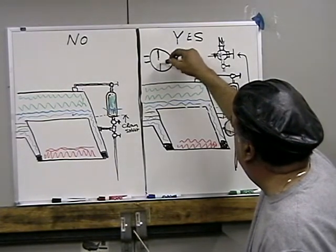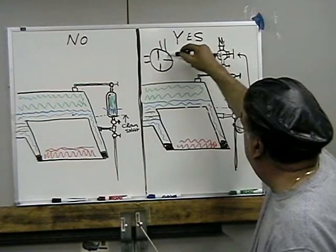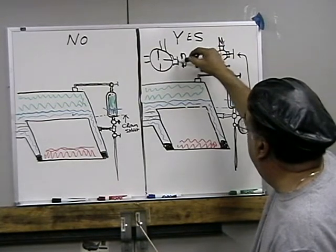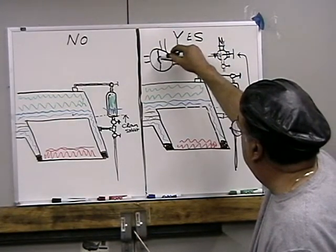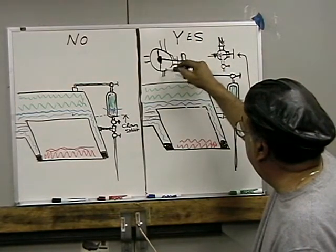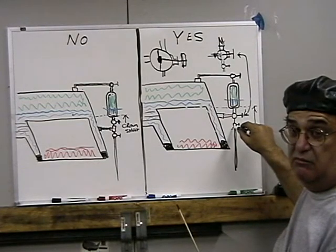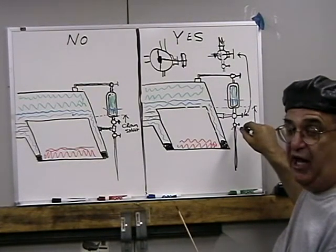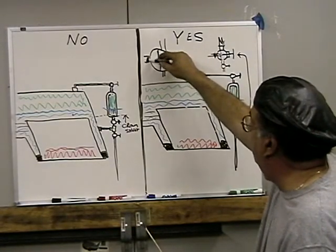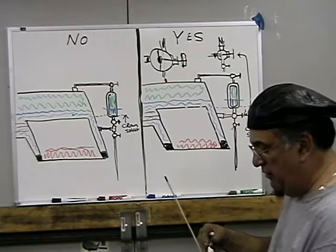Through this, you know, and then the inlet is up here, and then the stem with the valve handle out here, and the stem with the shut-off part. And then what you do is you tap this right here, and that's where you can put another valve to be able to blow it down. So by shutting this, it cuts the steam off from here, still keeps this open to here. By opening this valve, it's going to blow down through.